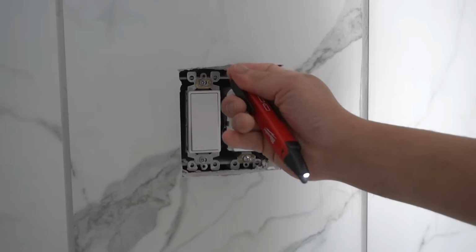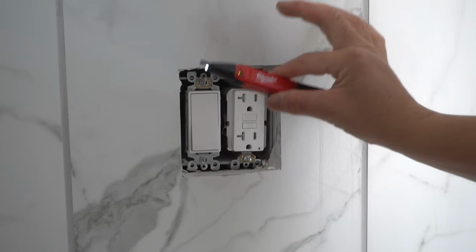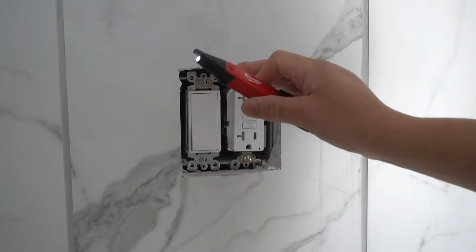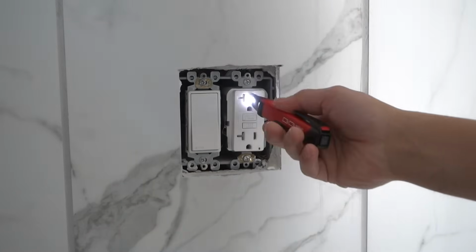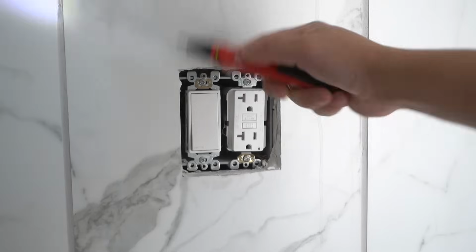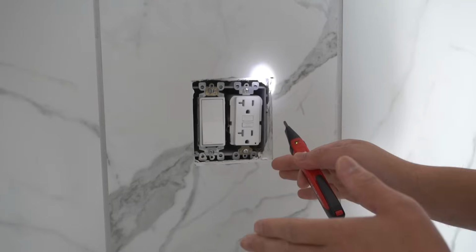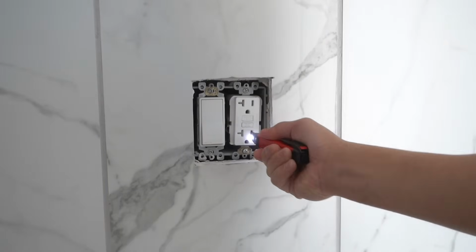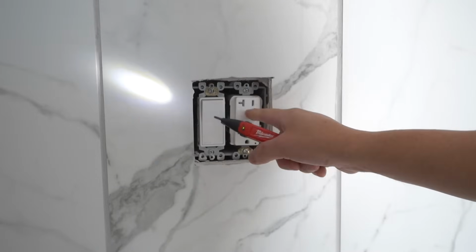So what I'm going to be using is my voltage tester. This one's by Milwaukee. If you're interested in this specific one or something similar, and all the tools and materials that I use within this video, I'll leave all the links in the description down below. Insert one inside and you can see that there is power. Let's go to our circuit breaker and turn all the power off from the house. I just turned off the power from the main circuit breaker. Let's test it out once again. And you can see there's no more power feeding onto this switch or this outlet.